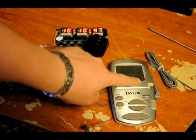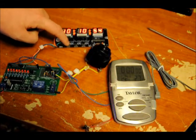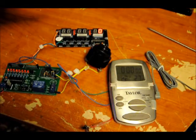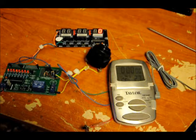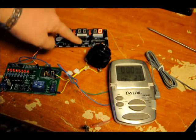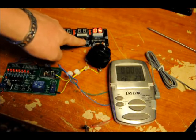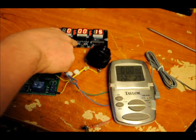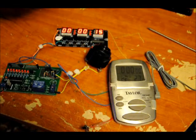I have to set this and I have to set the clock. To set the clock, I press the left-most button three times. That allows me to set up to 99 hours, 99 minutes, and 99 seconds. To change the first digit I press the right-most button. I'll set it to five, then press the middle button and press one. Then I'll keep pressing the middle button and set the remaining digits to zeros. When I next press that middle button, the clock will start counting down.